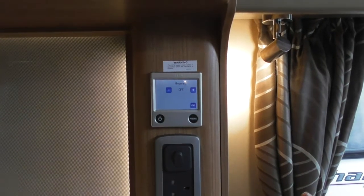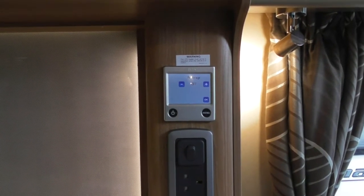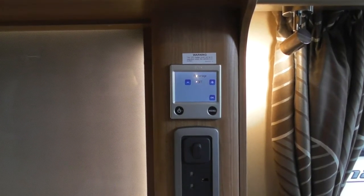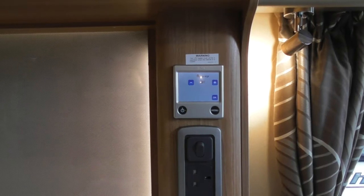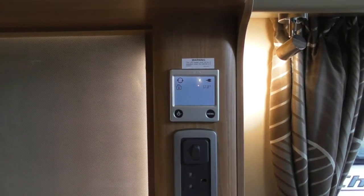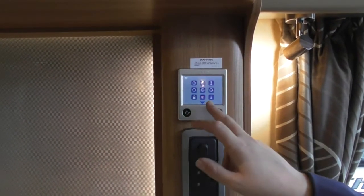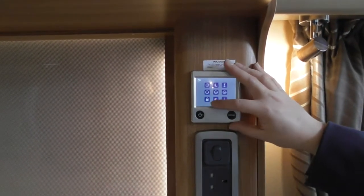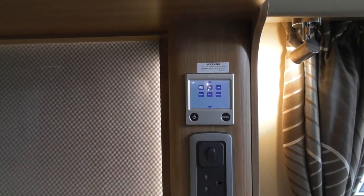Further down the settings: key beep if you want it to beep on every press, sunshine icon for screen brightness, LAN for language, a key lock that locks the screen on standby, and external connectivity to pair a mobile phone so you can control the panel via your telephone. The amp setting is a particularly useful one — you can set an amp limit for your heating system. So if you're on a site with only 10 amps, set the limit here and the system will control the boiler's draw. If it sees a power surge it'll switch the boiler off until power drops, then the boiler kicks back in — it won't be your boiler tripping the site.